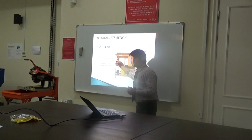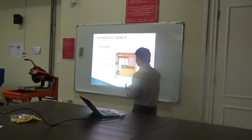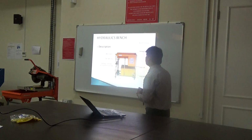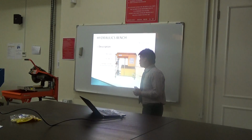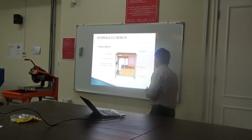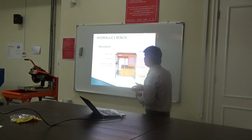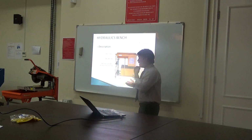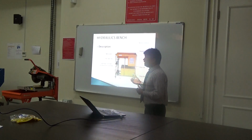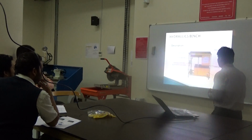And this second one is called the control unit. It has two switches. One switch is the circuit breaker and the second switch is used for running the centrifugal pump. Then we need to understand the importance of these two switches. The first just gives the power. In case of any earthing problem, overload to the system, or fluctuation, the circuit breaker automatically trips for your safety. And if any student causes an electrical problem, the ground voltage will increase and the system will shut down automatically.